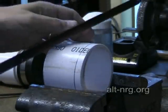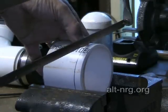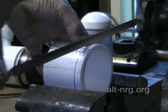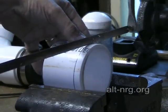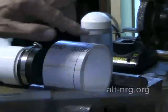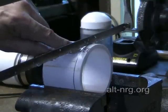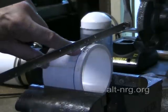Here's the trick to doing it with a hacksaw. I'm going to use my thumb as a guide on the top of the PVC and just start my cut. I'm going to make my cut just so that I see a part of the line I've drawn exposed. I want to make sure I'm cutting straight and smooth. And as soon as I break through the PVC, I'm no longer going to use the blade to cut on the far side of the pipe — I'm only going to apply pressure on the blade to cut through the near side. I'm going to spin the pipe around to constantly meet this line so that I can guide the blade very close to the edge of the line all the way around.